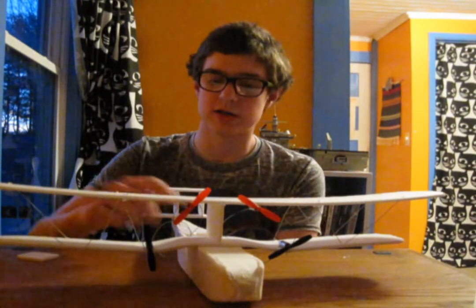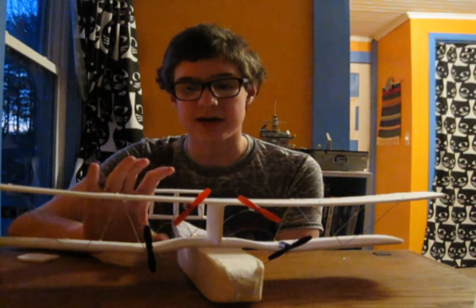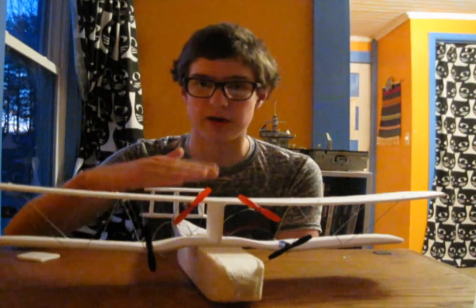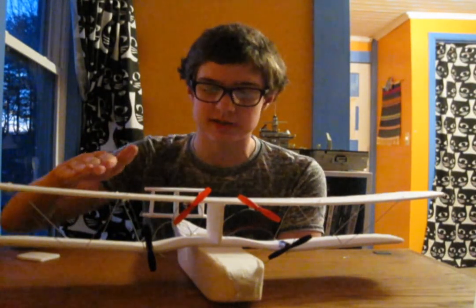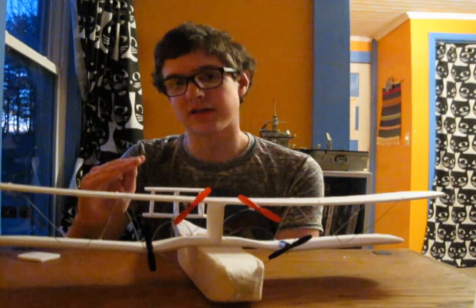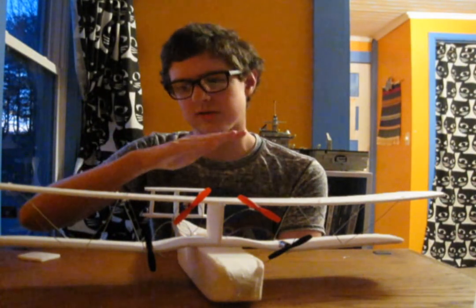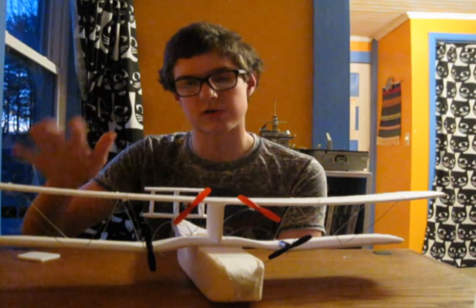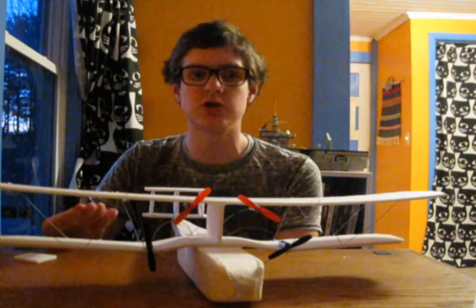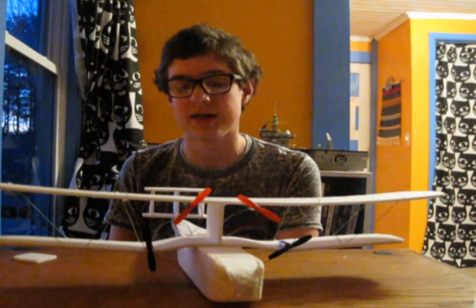So I send signals to the flight controller, which thinks it's still in the drone, and then it just varies the motor speed to control the pitch axis, roll axis, and yaw axis. Because of the way this is mounted, it only actively stabilizes the pitch axis, so the plane can still tilt and move in the roll and yaw, but that's not much of a big issue. And the pitch axis is super stable — it's really amazing. You can just take your hands off the controller, and the plane will just keep flying. It's kind of insane.